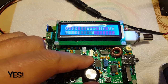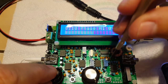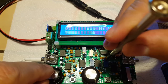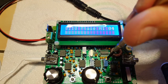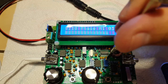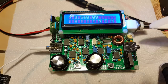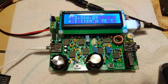Phase high — did I miss that? Yes, phase high is the last potentiometer. R17 again for minimum. I'm on 9, now 7, 6, 4 — I have a 3 here — this is just about the minimum. So I went through the four items of the alignment maybe four or five times and I think I got it right.